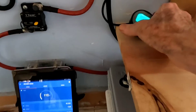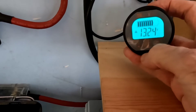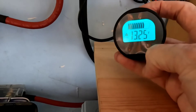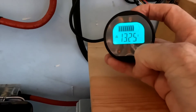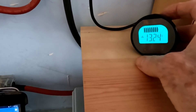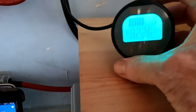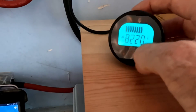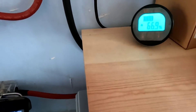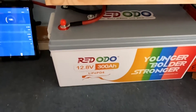The monitor is reading the battery at 13.24 volts with 120 watts coming in — though that's not completely accurate since voltage fluctuates during charging and discharging. The only way to accurately know your battery's state of charge is at rest. We can see 8.2 amps going into that battery, so it is charging and well on its way — probably get there tomorrow if the sun cooperates. Very easy — that's what you call a drop-in replacement.